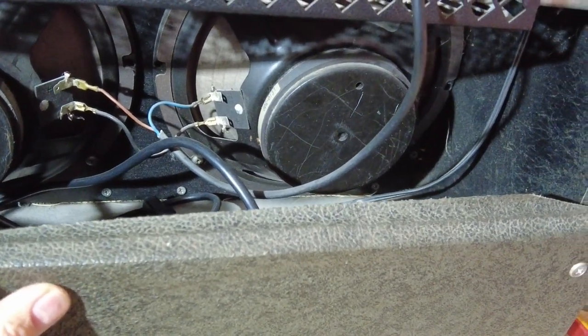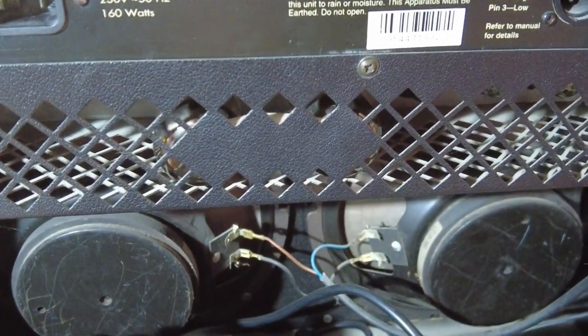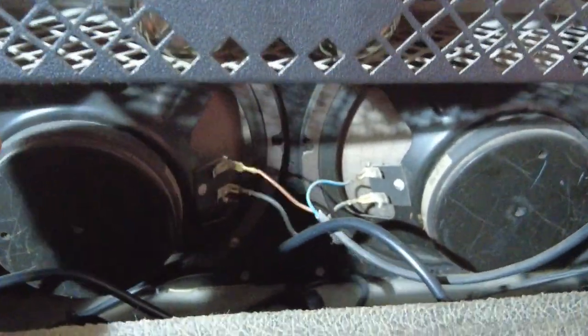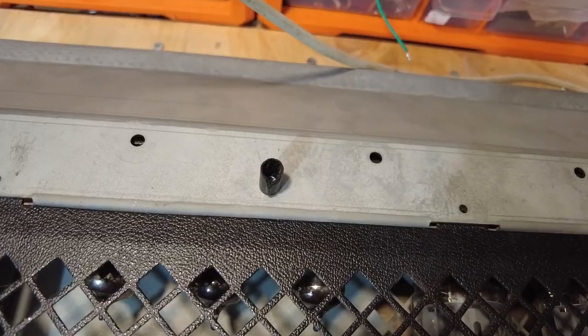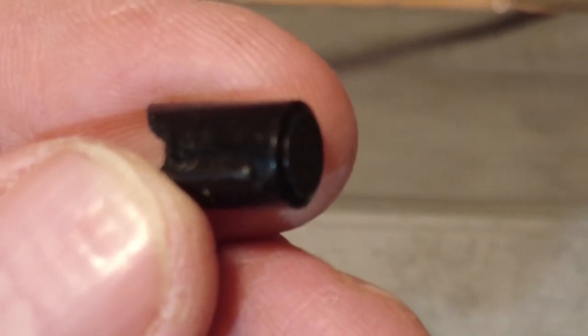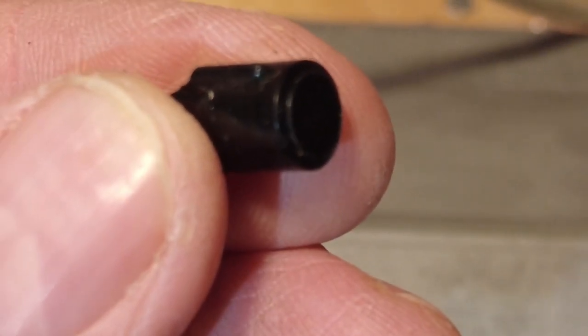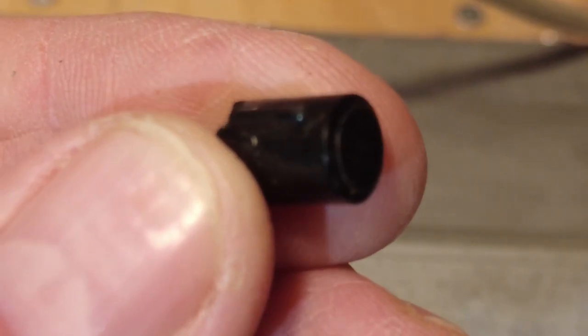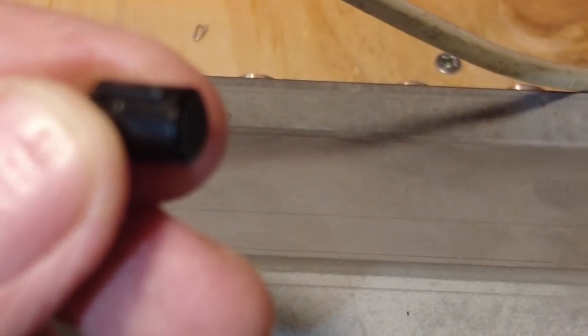So now this amp's on 6L6s, and these transformers to me seem, if you look inside, you can probably see that they seem a mite small on these. Well, look what's just fallen out of there. That's the valve guide that snapped off. You usually see that a lot. We see the pip on there. That actually guides the valve into the socket correctly, so you don't get the pins the wrong way around. So I don't know what that's about, whether that's off another valve previously.